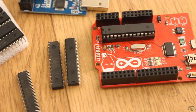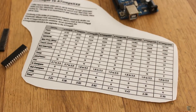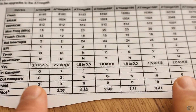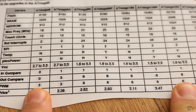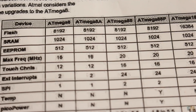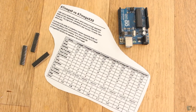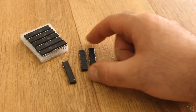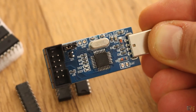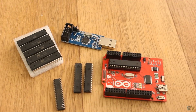So the difference is interior. Here we have a table with the memory and blocks of the ATmega8 in comparison with other AVR controllers. It has less PWM pins, way less external interrupts, and less memory. So how can we use this IC? We have two options: write the C code, create a hexadecimal file and burn it using the USB ASP programmer and some other software, or use the well-known Arduino IDE interface — and we will do just that.